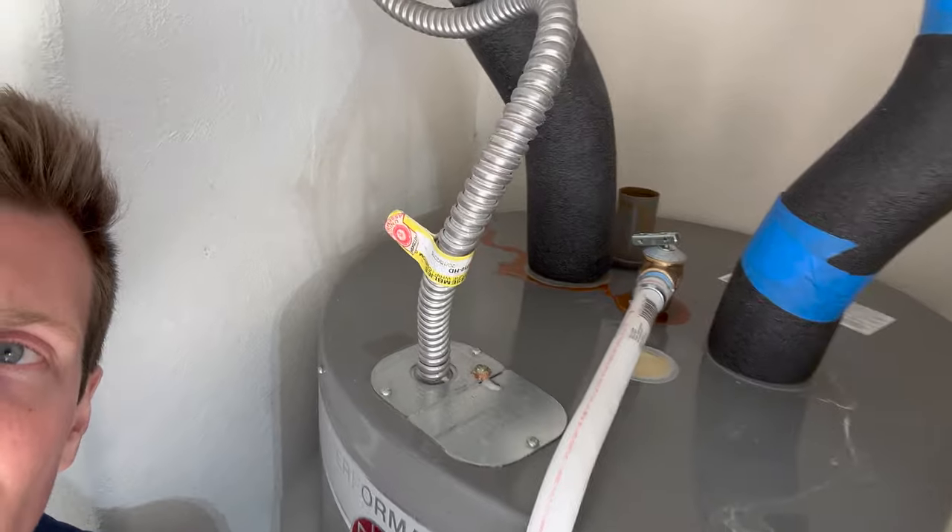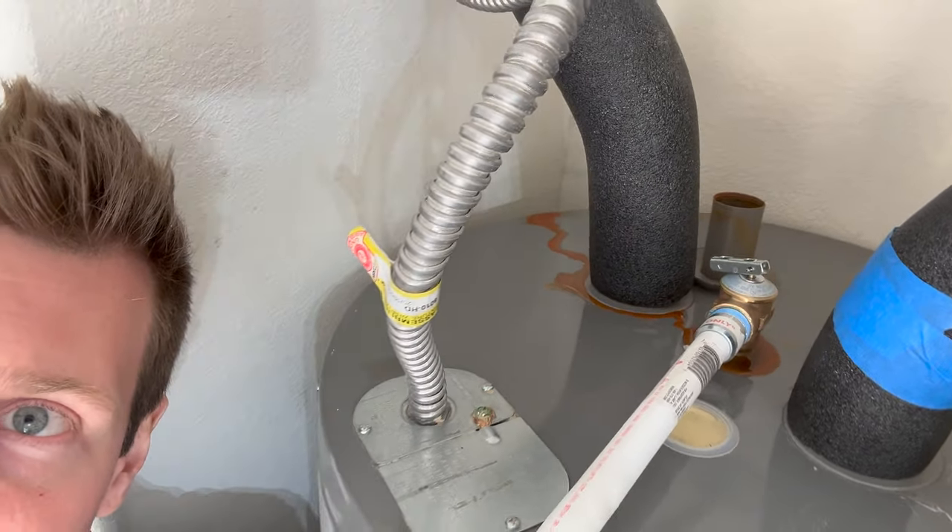Let's take a look at this leak. Before we get started, if you could give me a like on the video and subscribe, I would really appreciate it — we've got a lot of great DIY projects coming up this spring and summer. You can see it is leaking right from the T&P valve at the top. It's got a nice little sediment river and that shows you that it's a really bad sign and this tank is unfortunately in bad shape. We have a brand new water heater that I just bought from Home Depot — it is the same brand, basically the identical model, just newer.